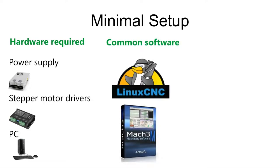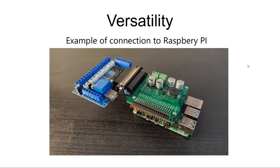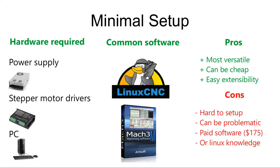This is probably the most versatile setup as you don't necessarily need a full-blown PC to operate it — you can connect this board to a Raspberry Pi with an additional LPT shield. I absolutely do not recommend this option to beginners or people that aren't good with Linux. And while I am fine with Linux, I abandoned this idea pretty early on after seeing how many problems people had with this setup. I'm not saying it cannot be done; I just don't want to deal with software issues if I can have an option that's almost the same price with fewer problems.